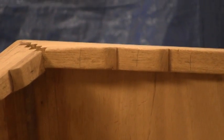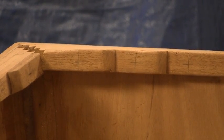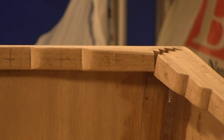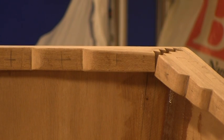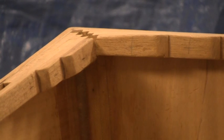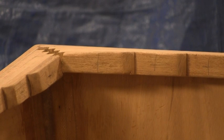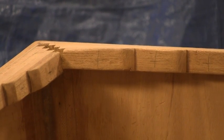Or not at all. One of the things I noticed when I quit the other day was that slope. You can see the slope on that one angle coming in on the transom side. Well, the one on the other side hadn't bent down as much, so I had to do a little bit more trimming with the plane on that corner to get them even. That's something you want to do. I was doing too much on this other corner for the video part, and I forgot the other one. So you've got to remember to do both sides at the same time, and then walk around the boat to see if it looks the same.